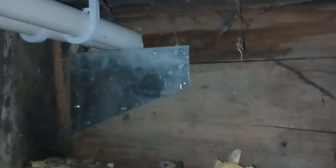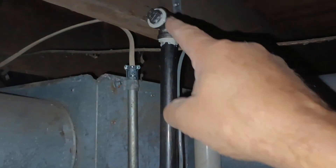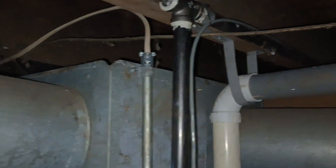If we ever ended up with a high efficiency water heater to replace that scary electric one, I left a T in the gas pipe and we can set the water tank anywhere in this general area and sidewall vent that one as well.